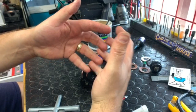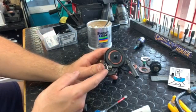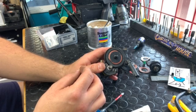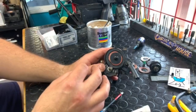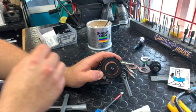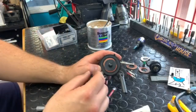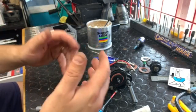We want to have these gears for this style of gear. So for 64 and 48 pitch, which means very fine, okay, we want that gear mesh on the tighter side. We still want to have a little bit of play, but we want it very close. When you get into 32 pitch or 0.8 mod or 1 mod, mod 1.0, you want that gear mesh to actually have a little bit more space, okay?